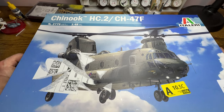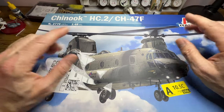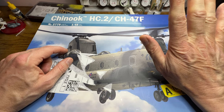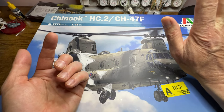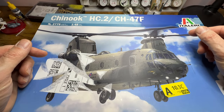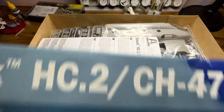It's quite an uncommon aircraft in that it has two rotors — forward and aft — both rotating in opposite directions. This means the aircraft doesn't spin opposite to the rotor. A standard helicopter has a vertically placed tail rotor: if the main disc rotates clockwise, the aircraft through inertia attempts to rotate anti-clockwise, and the vertical rotor prevents that. Failure of the rear rotor results in uncontrollable spin. The Chinook avoids this with its tandem rotor design.